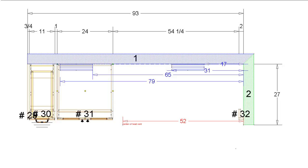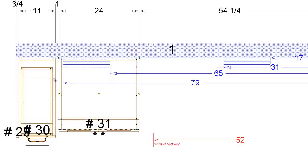The depth of my sink cabinet is going to be 22 inches - that's from the back wall to the front of the cabinet case. Vanity cabinets are always 22 inches in depth. You can go a little bit more, but I wouldn't go less because the sinks get a little cramped in there. You want to have enough room to attach your faucets, and a lot of the newer sinks are getting bigger and bigger - wider, shallower - just lots of stuff going on. So 22 inches from the back to the front of the sink cabinet.